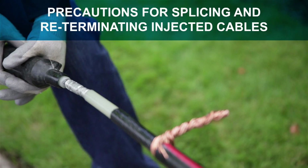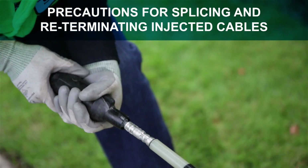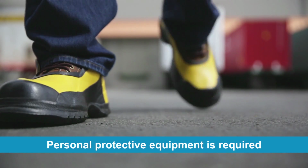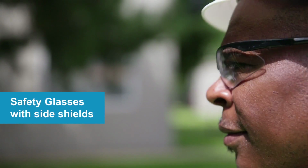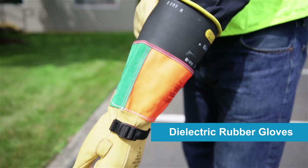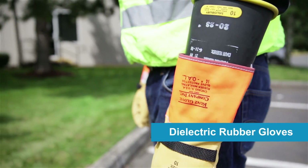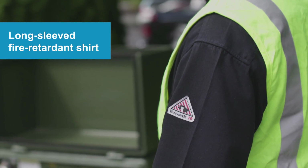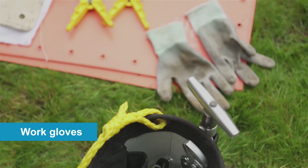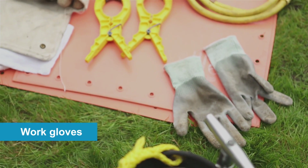When splicing or re-terminating injected cables, various precautions must be taken. Personal protective equipment is required. Safety glasses with side shields must be worn. Rubber gloves are required, and when handling injection equipment connected to energized cables, long-sleeve fire retardant shirts are necessary. Finally, work gloves are needed when working on confirmed dead equipment.